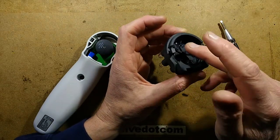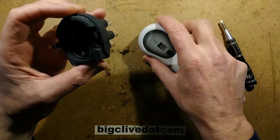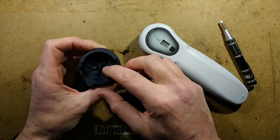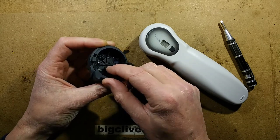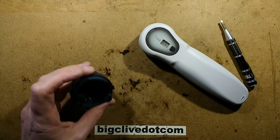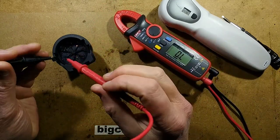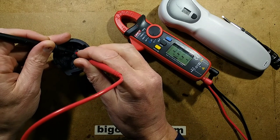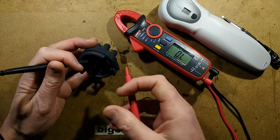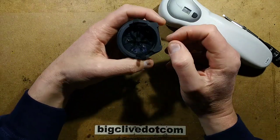I've got this off now. I can see a little wire going into the middle of this, presumably to the high voltage transformer, and then it couples onto these glass tubes. Do these even have electrodes in them? I don't even see electrodes - I wonder if it's just coupling. Is this a conductive rubber in some way? Let's get the meter. Yes, it is - it's a layer of conductive rubber which is coupling onto the back of those globes. Is this conductive at the front? No, it's not. That's quite neat - quite a clever way of coupling capacitively onto the back of the glass globes.